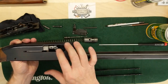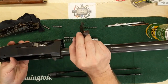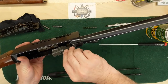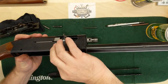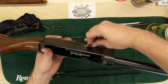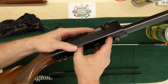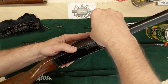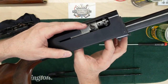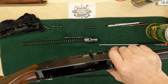Now once I get this slid back I typically like to take the plate — the actual cock and handle bridge plate — and go ahead and get it in there at an angle like so. The more forward you go, the better angle you get on that. See if I can do it slowly to show it — there you go, just a little bit of an angle.